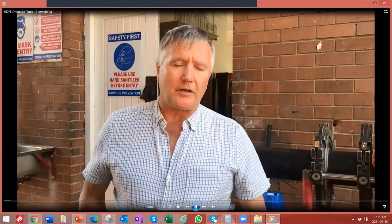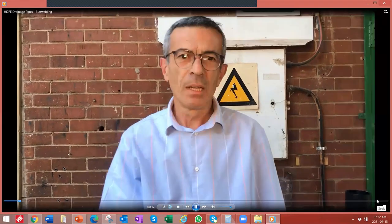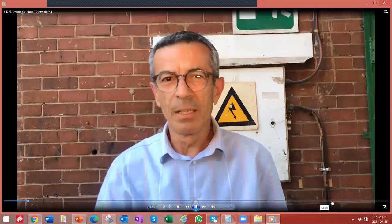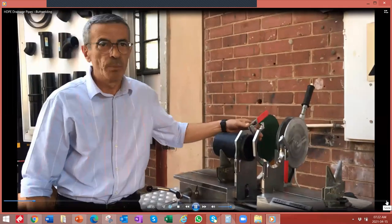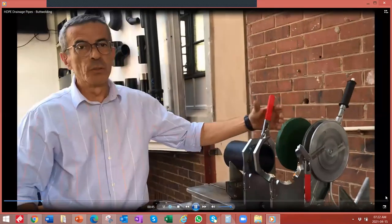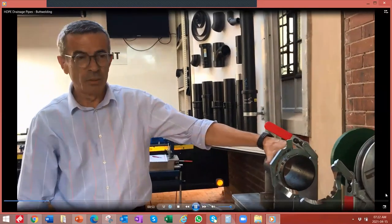We're going to run through the basics of joining HDPE drainage pipe, and Zoran will take us through that process. My name is Zoran. I want to show you the method of joining HDPE — particularly the butt weld. Because we find lots of people not very familiar with the machine: each and every part of the machine is adjustable. HDPE expands and contracts a lot. You don't need to use any force — with just two fingers you can close the clamps and the pipe is secure.